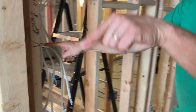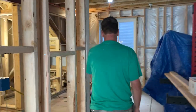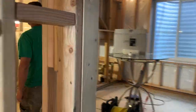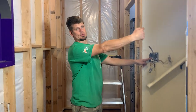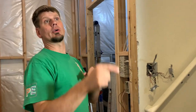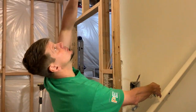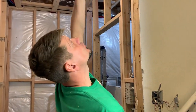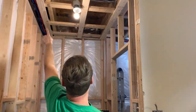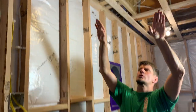Keep in mind that when your bedroom is in the back of all this area and it's an island, you've got to have a three-way system to walk out and go upstairs. You also have to transfer over your old wiring that was already down here — demo that out and figure that out. The old keyless fixtures are now going to be two Nora trims. He did have to drop this down to put some shim because of plumbing that was there. He'll wrap that beam and do a transition — some people decide to paint it.